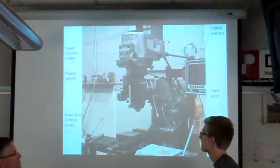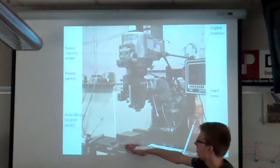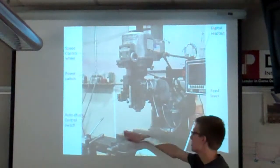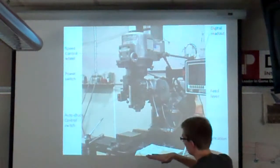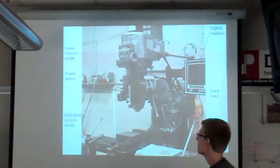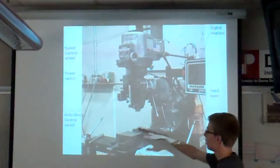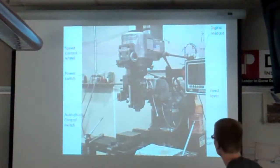I would want to decide where I want to have my X and my Y, because this whole bottom part actually can move around like this and this. So that's how you're gonna take material off horizontally. You're gonna move the metal into the piece and then move it around to take the area that we need. So yeah, you can zero them on this, which is like setting a point where it's basically 0. And then it will reference all distances moved from the point that you've defined as 0. So that's pretty cool.